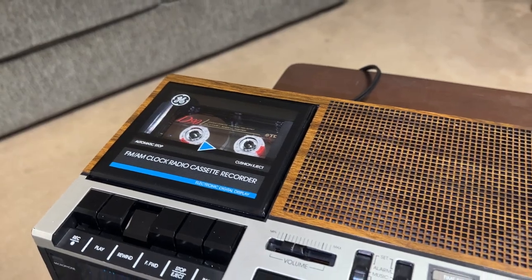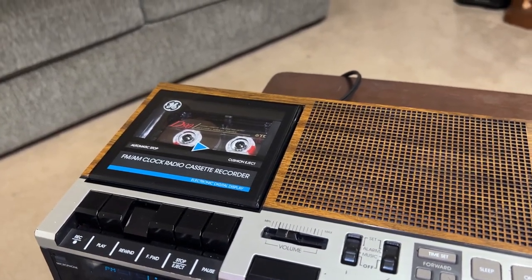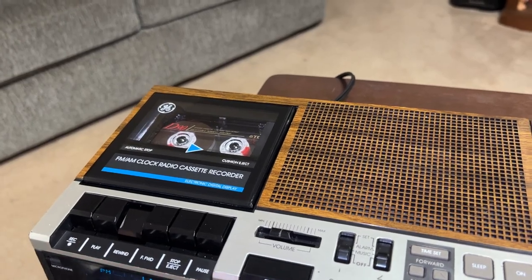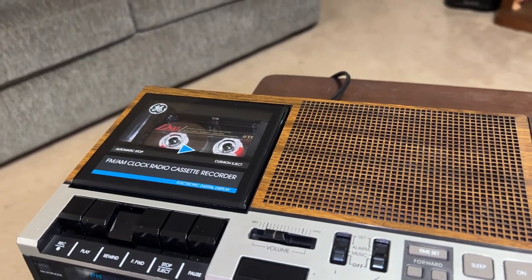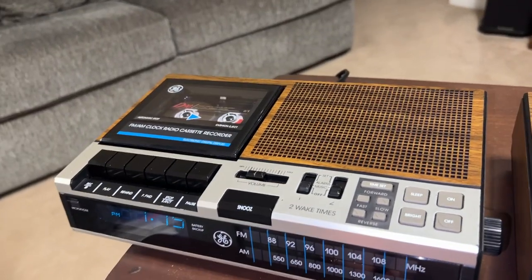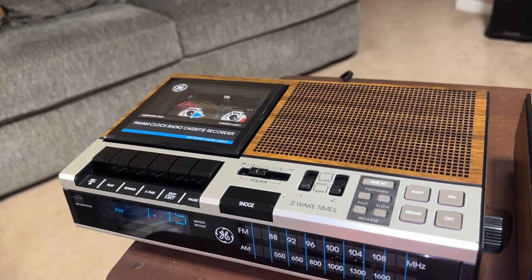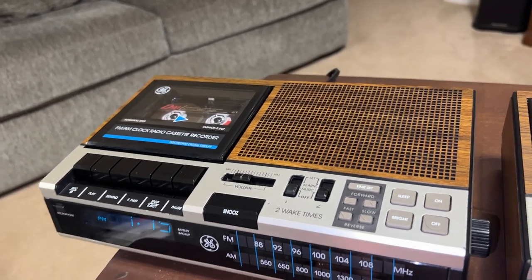Oh yeah, also observe, it's at the end of the tape. The rewind is still pressed. No squealing noises, no nothing. The belts, the motor, everything's free moving because of that clutch. If I didn't change that out, so that basically I gave this thing an upgrade. If I didn't do that, right now you'd hear that squealing sound right there. That's your belt.